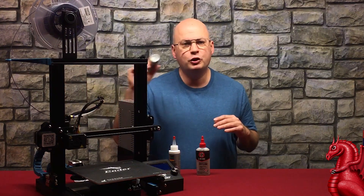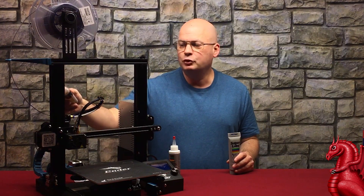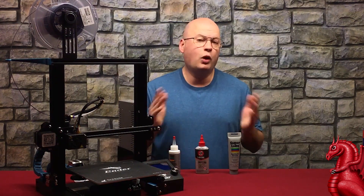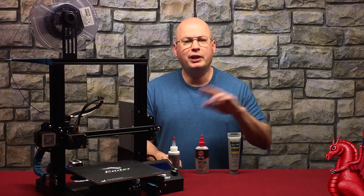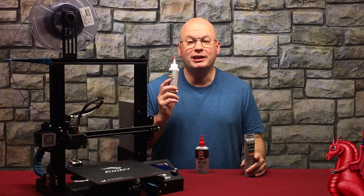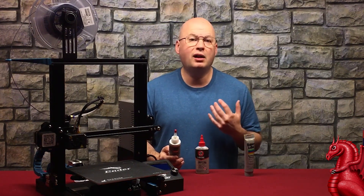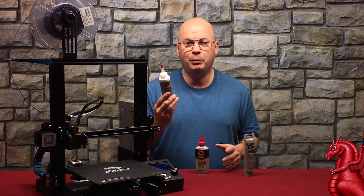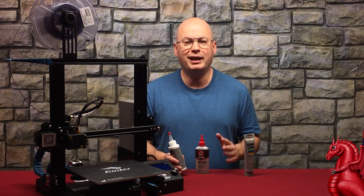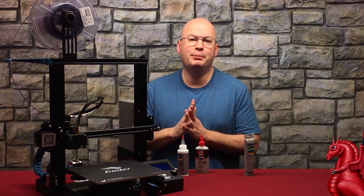If you're using grease, put two or three small dabs at even intervals and run the axis up and down a couple times to distribute it. For dry lube, apply about five drops down the length of the axis and do the same. For steel rods, just put a drop or two on the rod and use a paper towel to work it in. In all cases except grease, if you can see the oil when you're done, you've put too much — too much oil attracts dirt just as fast as too little. Wipe off the excess; there will still be plenty on the surface to protect it.